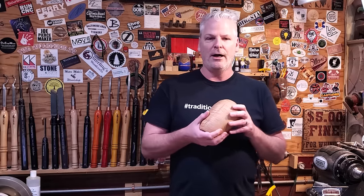So with the air saw, too, I use a metal, like a metal hacksaw blade. It's not a hacksaw blade, but it's a fine tooth metal blade, and it will cut just like butter. I mean, you can literally draw with it. So I had a comment on an older video I'd done years ago, and the guy was talking about using a hacksaw blade cutting wood, and he thought that was dangerous, and it's the exact opposite. I actually had the lathe spinning and I had a piece of wood and I didn't want to waste any of it, so I used a hacksaw blade. And because the teeth are so fine on it, it won't catch.